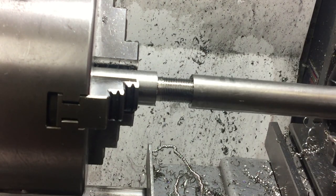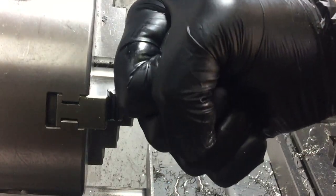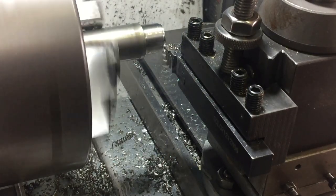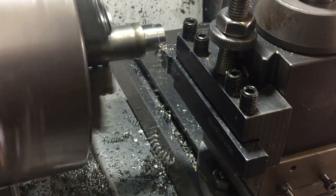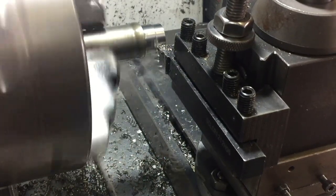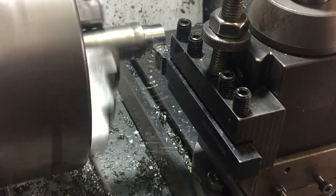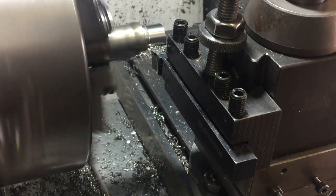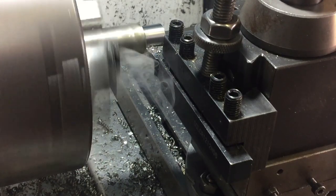After cutting down to what I thought was right — no good. That's the next disaster. It's way too sloppy. I'm going to have to do that again. So back to the lathe — cut it off, cut down to size again, and then single-point thread again, hopefully with the external size correct this time. These are just the joys of being a self-taught backyard hobbyist, and in the end it's no big deal to have to redo it.